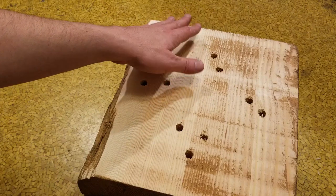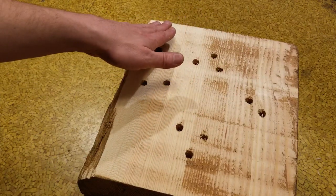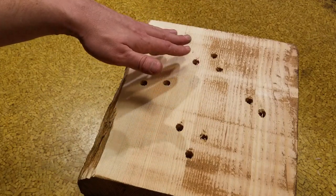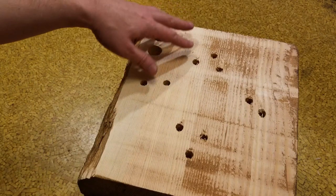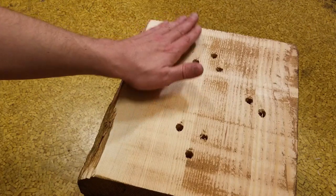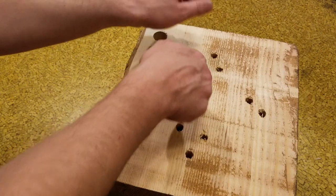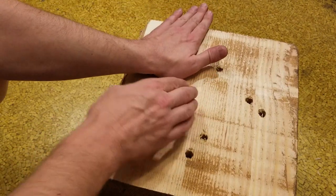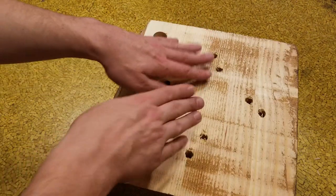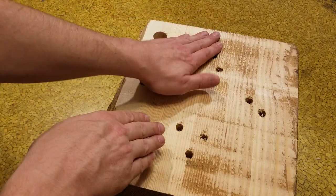If you have a door jamb that's crooked and it's touching on the top and the bottom, you would just start off, hit from the edge, and take a few passes, and that's how you get an angled surface. Another nice aspect of the power planes is they have pretty square edges. One of the biggest problems with belt sanders is when you come up to the edge, really trying to keep the belt sander under control and level so you don't get any rounding, whereas with the power plane, because of its wide shoe, you're just pressing down, and as it comes across, it's still laying flat on the back.